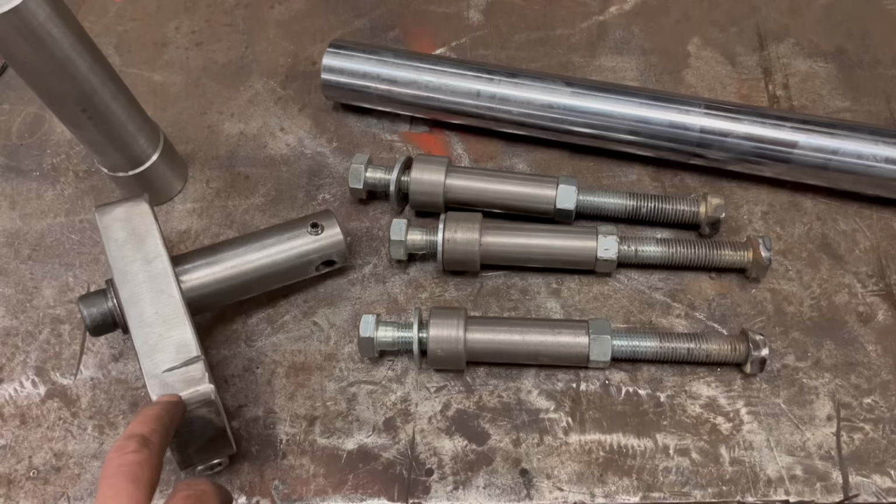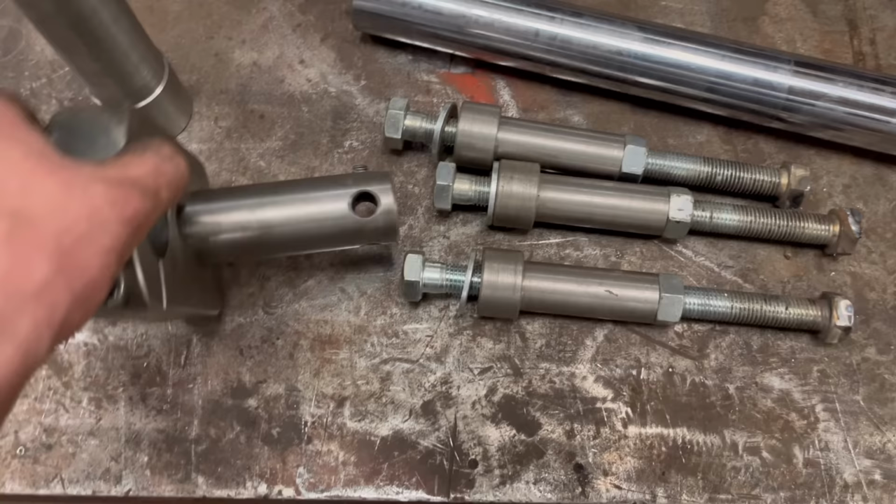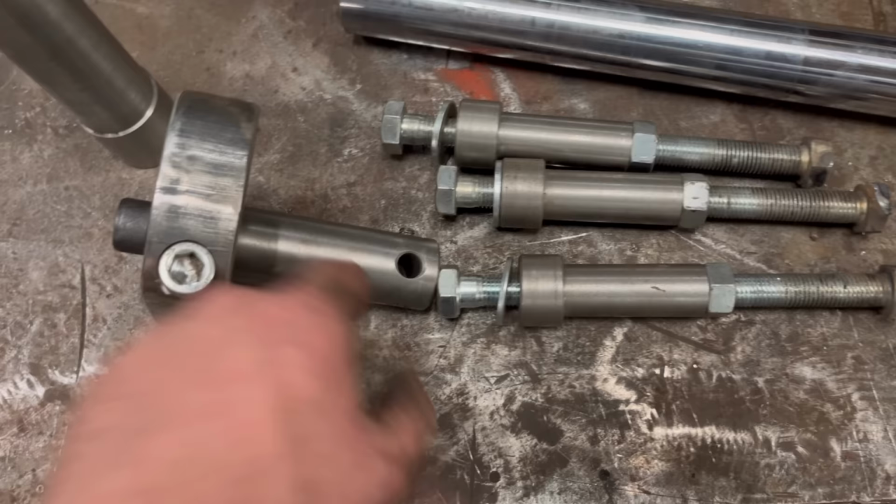So there's definitely some improvements I can make for next time. I think I need to make some longer and heavier duty stands because they're not rigid enough. And I think maybe the tool height was slightly wrong. So whether I should drill a new hole slightly offset just to get the tool slightly lower. That one's bang in the middle. So I might experiment with that next time.